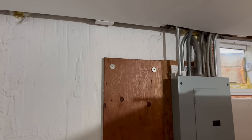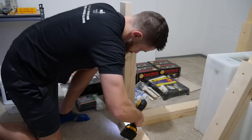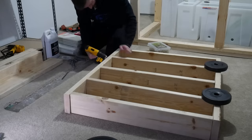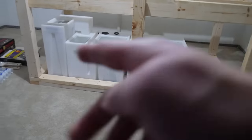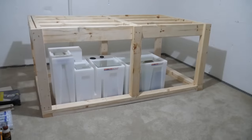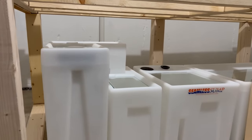From the previous video, I built the tank stand out of two by fours, some upright guides and supports, and then I used two by sixes for those box frames that will be supporting the weight underneath the plywood aquarium. Similar to an acrylic aquarium, you need support all the way through the bottom of the tank, not just the edge like you would for a glass aquarium. I took inspiration from this tank stand from Aquarium Domain, another great YouTuber, and I followed his footprint — I just have a slightly bigger tank than the how-to series he put together.